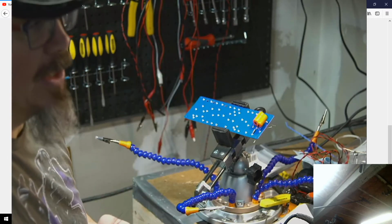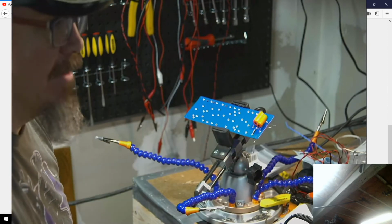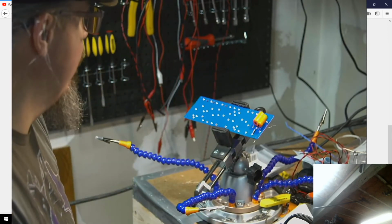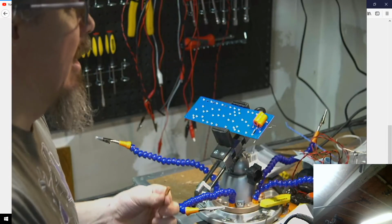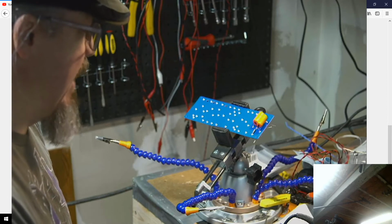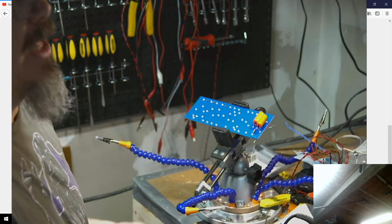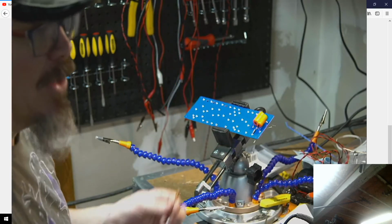I don't know if it really does cause what it causes or not, but you can see this is a carbon film instead of metal film. They're supposedly supposed to add a little bit of warmth. Now, I don't know if that's measurable. I'd love to find out if somebody has ideas about a true test. A lot of this stuff, the complexity of making a true test is that to make a scientific test, you need to have every other variable locked and solid and not changeable, and then just somehow quickly switch between the two and see if you notice any difference in the tone.